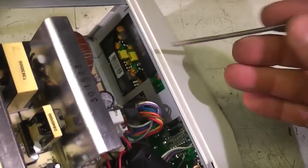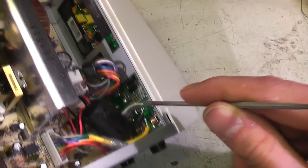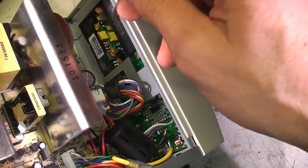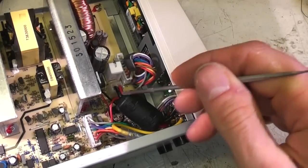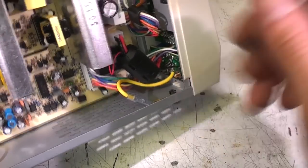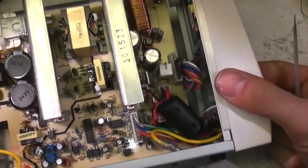At the back of the front panel, there are actually separate boards. There's an output terminal board here, the board with the encoder on it here, and then a separate board with the meters and the display. And we've got noise filters on all the wiring to the front panel as well, so that's the ground wire from the front panel. So yeah, it's clearly a pretty decent quality of construction, and for this price range I think that's entirely acceptable.